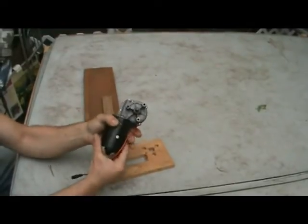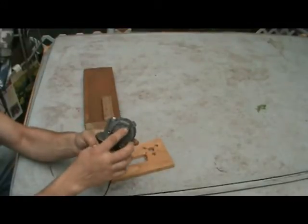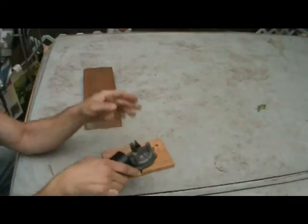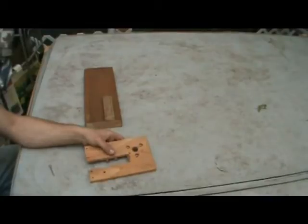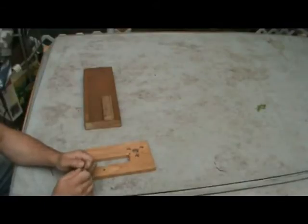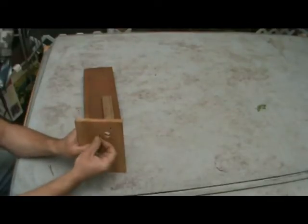Another thing you can do if you don't want to push hard on it is you could put a little bit of paint on each one and then set it down on the board so it leaves little paint marks. In fact, that would probably work good with this because the first thing you're going to do is drill through with the size for the bolts. Those are the mounting bolts. Those would come inside your kit if you got it from Monster Guts. So once you've drilled through and you've got three holes that are the size of your mounting bolts,